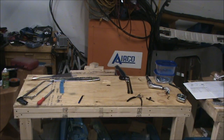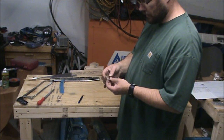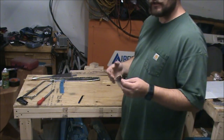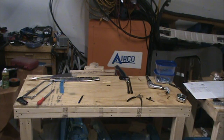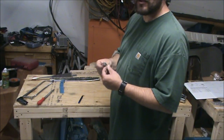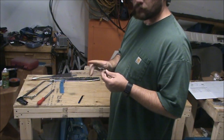That you need on page 9, which the first two pages are nothing but cutting stuff out, getting rid of the excess material, deburring everything, and then you start clecoing it together, and that's drilling. That goes on for 5-6 pages, about 4 pages really, and then like 2 more pages of starting to rivet stuff together. But where you need the Pro Seal is page 9.